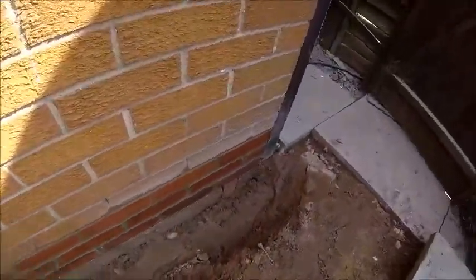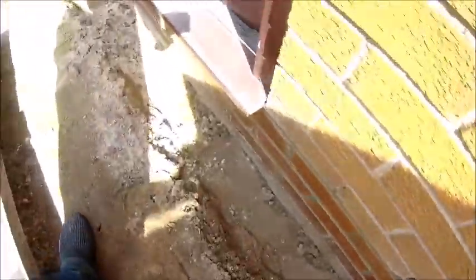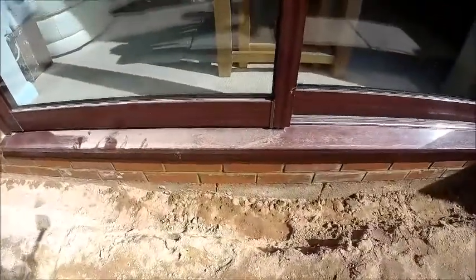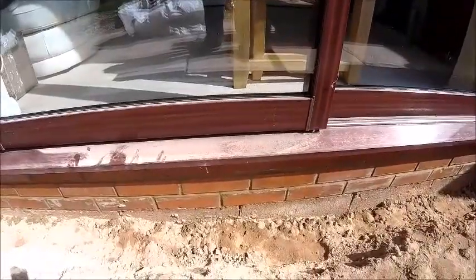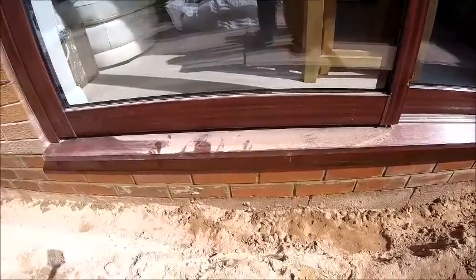All I've got to do now is basically fill that trench in there with some gravel, just to give it a bit of a soakaway. Because as he was grinding away, the mortar was wet through — it's sucking up moisture — so I want to try and give it a fighting chance to get rid of some of the rainwater. So some gravel in there, then lay some sand down, a bit of sand and cement dry mix, and get the slabs back down. But that is definitely a job for tomorrow.